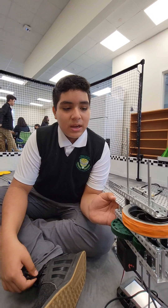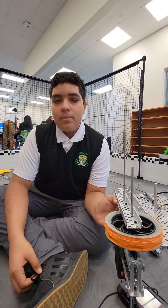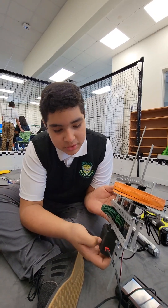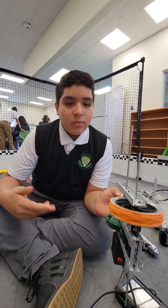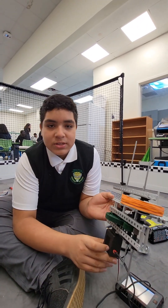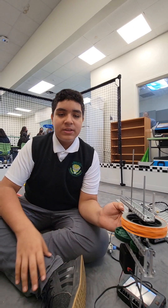How did you know that? Every time we tried to use it, it would just not spin. It had friction. What was the first thing you tried to fix when it wouldn't spin? At first we tried to use a red motor, which is used for as much torque as possible, and we just lowered the gear ratio a little bit to make sure it worked better. But that didn't work either. In the end, what worked is that we got a blue motor, which is specially geared for high speeds, and we lowered the gear ratio to 7 to 1, from the 15 to 1 that was originally.